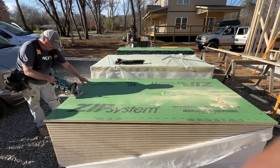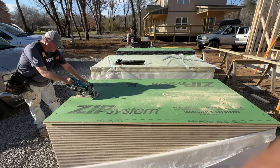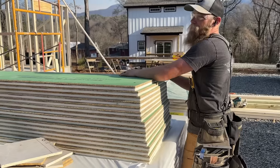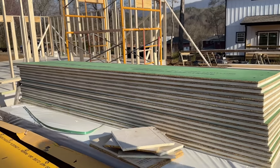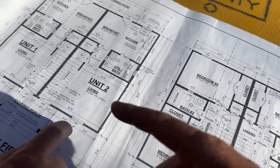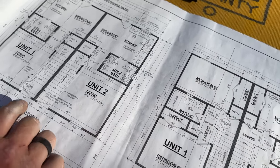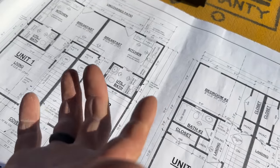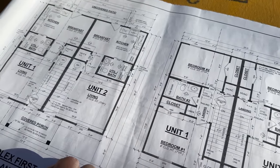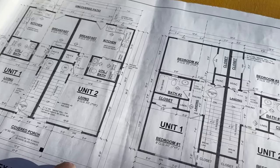Arlo is doing prep work so we can get going quickly tomorrow. He's ripping some of our zip-R sheathing down to two-foot by eight-foot pieces so we can have a full sheet of sheathing run across the floor system from the lower walls to the upper walls once we stack up the second floor. He's also taping the bottom of the sheathing where it's going to be about eight to ten inches off the ground to seal the foam layer. The dimensioning on our plans is a bit odd — it's outside to center of walls, which is a hard place to hook a tape or chalk a line. We'll have to do some thinking when we lay out the interior walls.